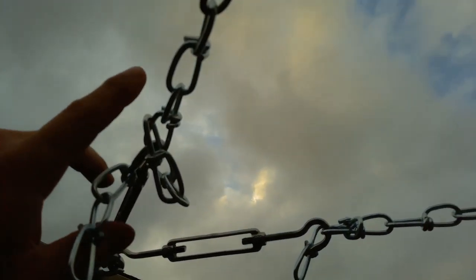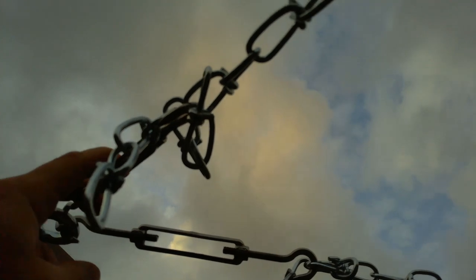So this is what we got here. We have a carabiner attached to the shade sail itself — it's about a 450 to 500 pound carabiner. Then you have 250 pound chain going to a turnbuckle, getting it nice and tight.